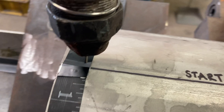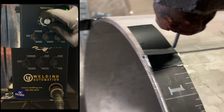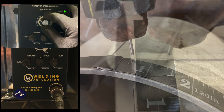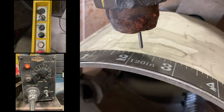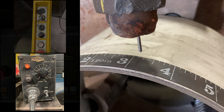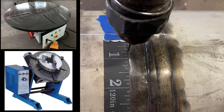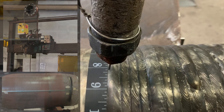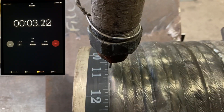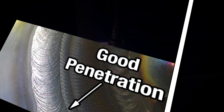Here's a different approach: instead of marking 1-inch increments on the pipe, you can use a soft measuring tape to mark time in inches per minute. This timing technique is scale invariant and can be used with any analog or digital controller. The technique transfers to any platform — from a turntable to a positioner, from a turning roller to a weld around to a seam welder. With a stopwatch, a soft measuring tape, good weld parameters, wire feed speed, and calculated travel speed, the results will be consistent and high quality.